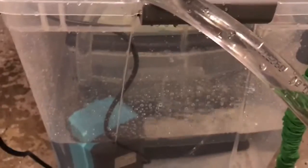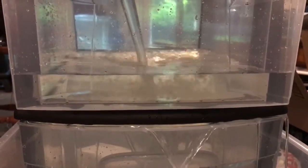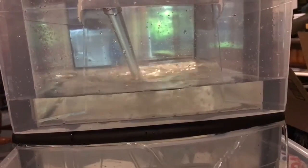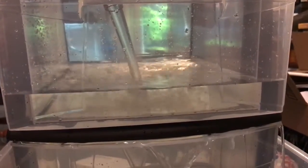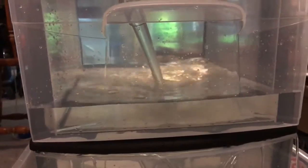And if you're wondering about the turnover rate you need, I'm looking, and there's a lot of debate. There's the old standard of 10 times per hour and all this stuff, but I'm shooting for 4 times per hour. So this is a 150 gallon stock tank I'm hooking this up to, and this is a 770 gallons per hour pump, but then you're gonna lose some of that with head height. That's how much is actually coming out right at the nozzle. So by the time it travels through the hose, it's not gonna be going quite as fast. So just adjustment to that, I went ahead and went a little bigger than I needed with the 770 gallons per hour. And I should get a good 4 times or so per hour. And this looks like it's holding pretty steady, guys. Alright, rock on. I'm going to turn all this off and then we'll move on to media.